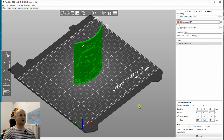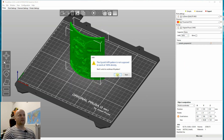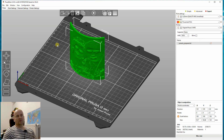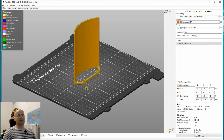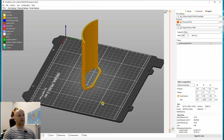This is now PrusaSlicer with the files I prepared in MeshMixer. You need 100% infill. I like to use the maximum number of perimeters — even if I don't change the infill, the perimeters will basically fill the maximum 3 millimeters. Layer height of 0.2mm, or if you want better resolution, 0.15mm is recommended. Approximately 5 hours will be the printing time with these settings. I don't use the brim because I added the holder on the back — but if you don't use a holder, definitely add the brim because you don't want it to detach from the bed after 4-5 hours of printing.